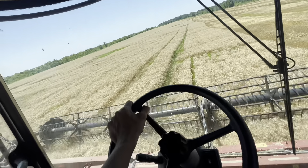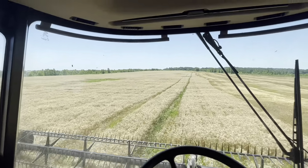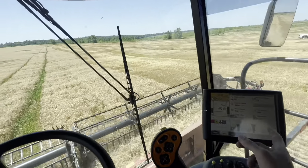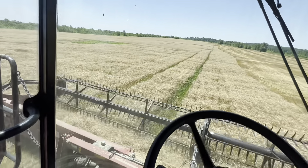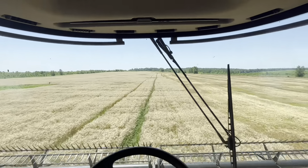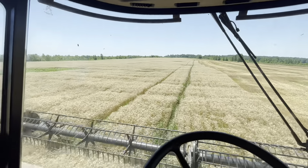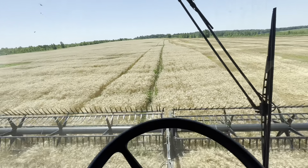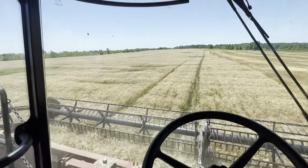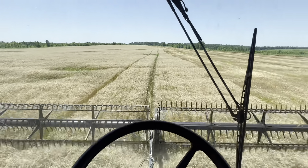I kind of know the yield monitor is running low. When we cut the first load, I weighed it and had my counter set on the combine to see how many pounds the combine thought it was — it was about 15% less than what went across the scales at the elevator. So wheat's actually even better than 80 bushel. Which is a good problem to have — those are just bonus bushels.